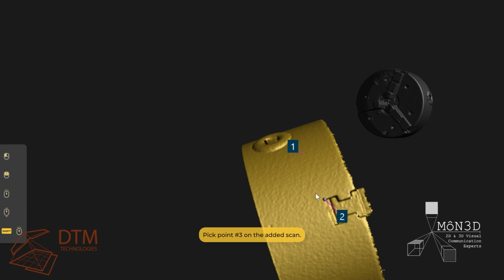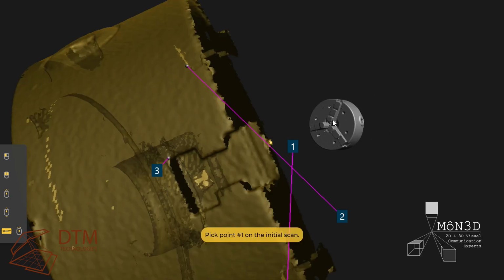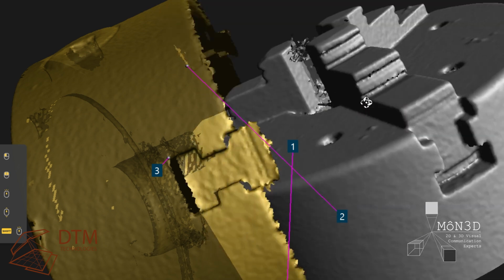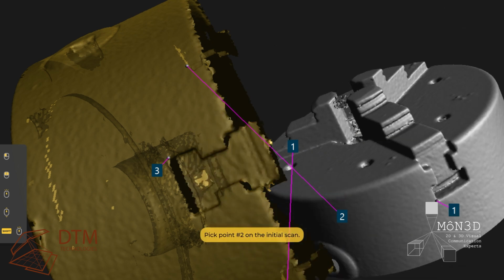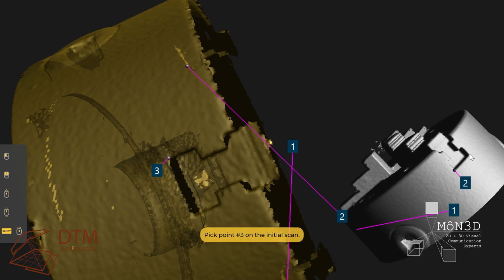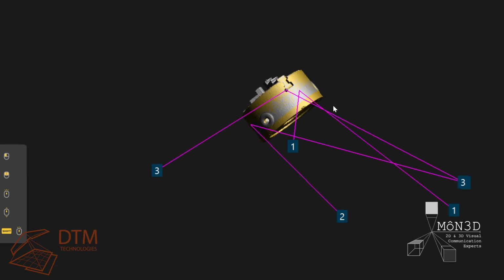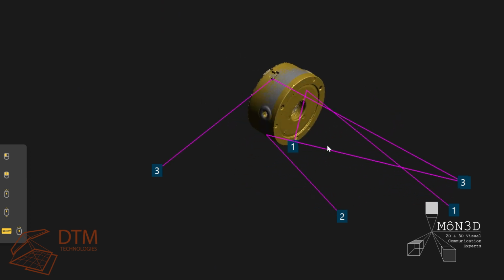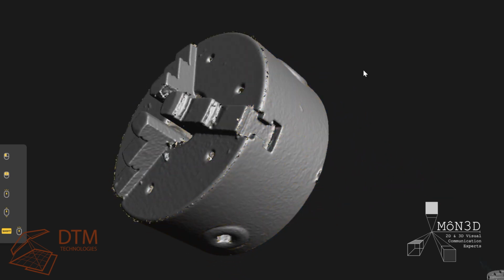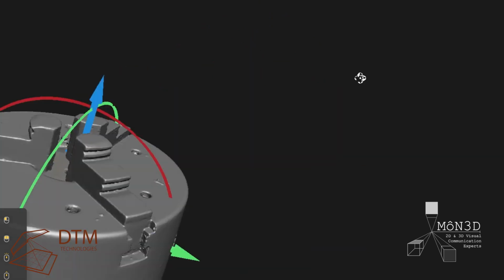Yeah, I have a Creality Raptor, which is a scanner for much smaller parts. I think the Peel goes down to 0.1 millimeter, the Raptor goes to 0.001 or 0.002 millimeters. In size, resolution is about the same, and the accuracies are good on both. The Raptor is significantly cheaper than the Peel. The Peel is more robust, it's designed for professional use. I think it's just a much sturdier unit, and the software is much more solid. No problems in the software in there.